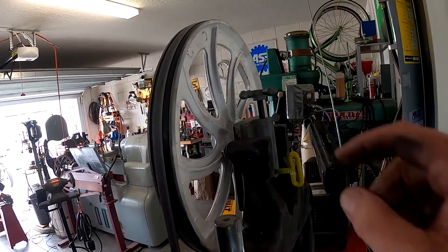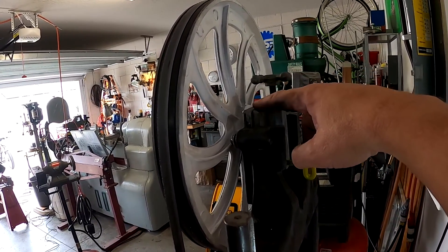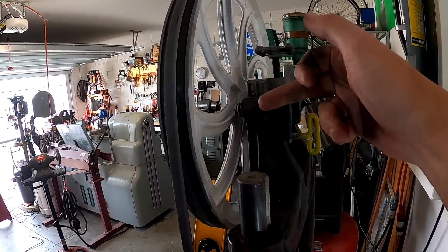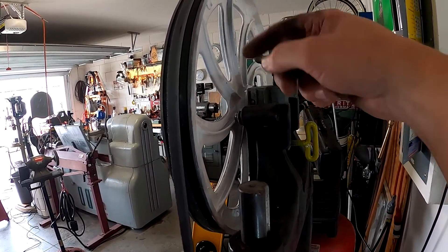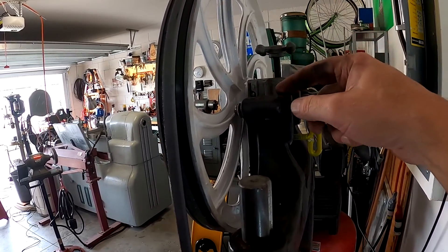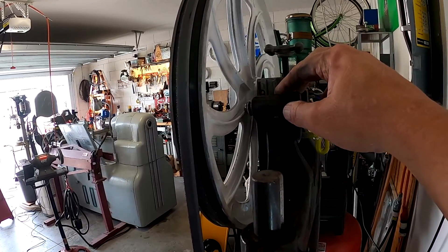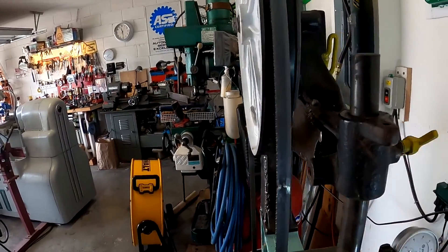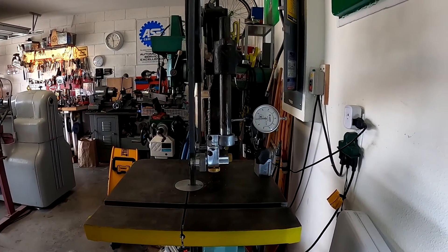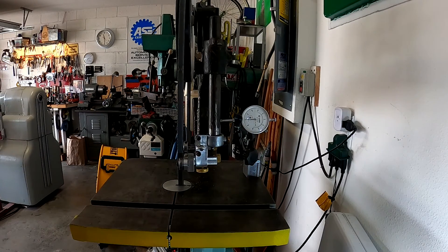In the intro to this video I put a dial indicator up here on the other saw just showing how much it's free to move up and down - that movement also transfers into here, which was causing the twisting. This piece here actually moves up and down less, meaning the wheels are less out of true than the other saw, so it doesn't put nearly as much strain on this arm. Now that we've got this all welded in and solid, let's go ahead and back up - I've got my dial indicator lined up, zeroed, true and square with some preload. Let's fire it up.